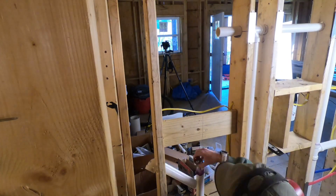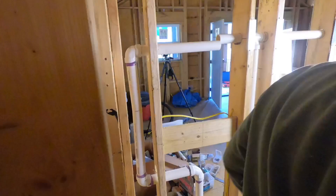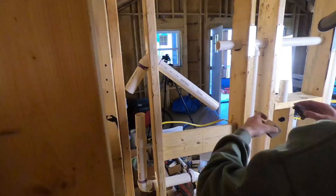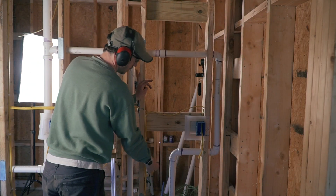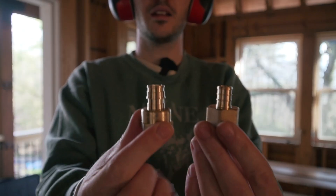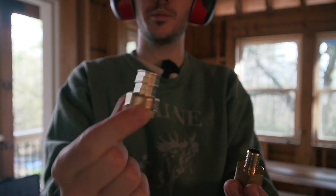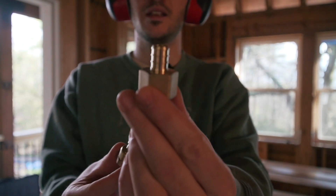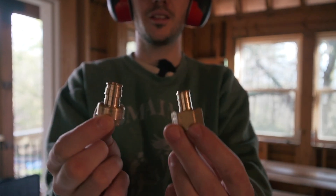What I did here is fairly simple — I'm showing you the accelerated version. I went 90 degrees to the left into the next stud spacing, then went straight up, then back 90 degrees to connect back to the original vent line. Now I'll have room to run my valve and then my shower. That wrong kind — don't buy that one, it's for expansion-specific PEX. The one I really needed is much smaller. Don't make the same mistake. I've gone back and changed all of these to the correct crimp-type fittings.